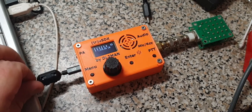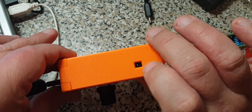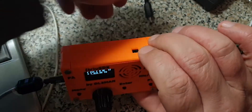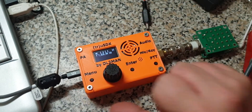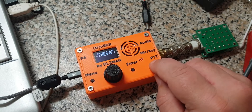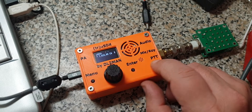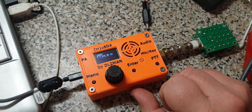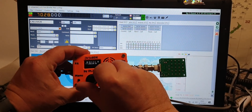In this case it's all about USB, you probably guessed it. What we have here is a barrel jack connector that will be the main power supply and we have a USB connector which will be an emergency power supply giving you 0.46 watts — about 0.5 watts — in an emergency situation where you only have, for example, a USB power bank available. And you can update firmware via USB and of course we have CAT control.